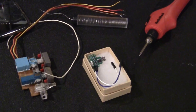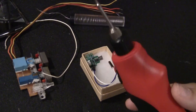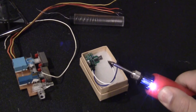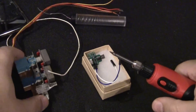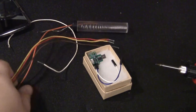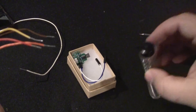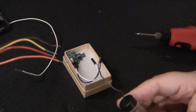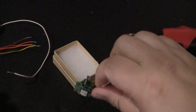While the case dries, we're doing the soldering portion. I've got a battery-operated soldering iron from RadioShack — recommended for a small project like this. Hold the button for seven seconds and the tip gets hot enough for our rosin core solder. This is the original Nintendo power switch. I'm going to tin these wires first — when you tin them before putting them on a circuit board, they go in perfectly with no excess solder.